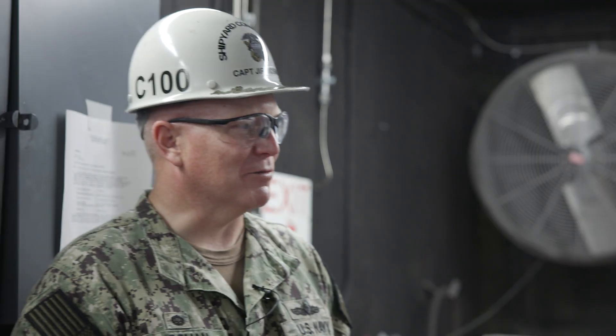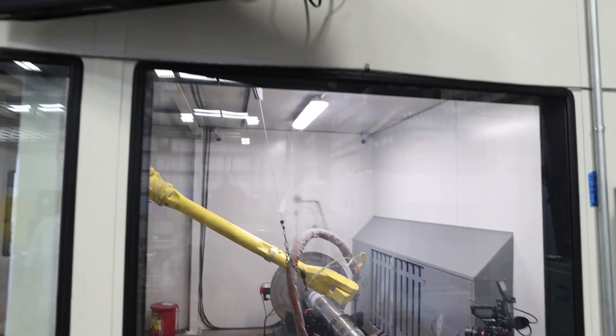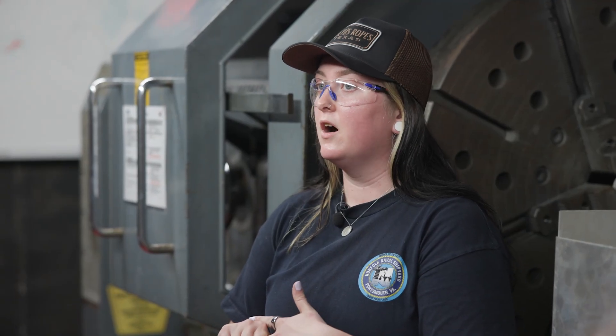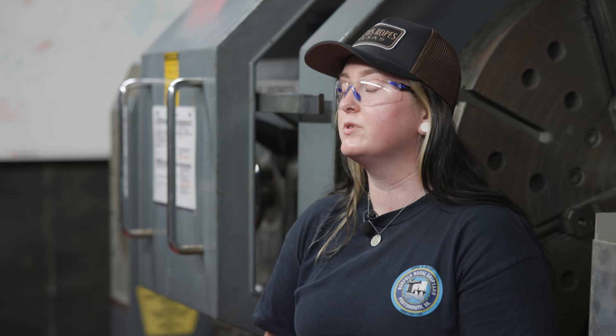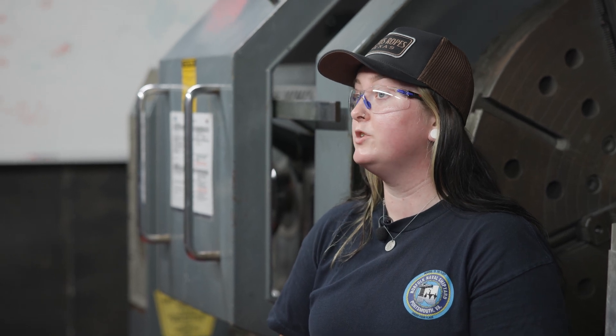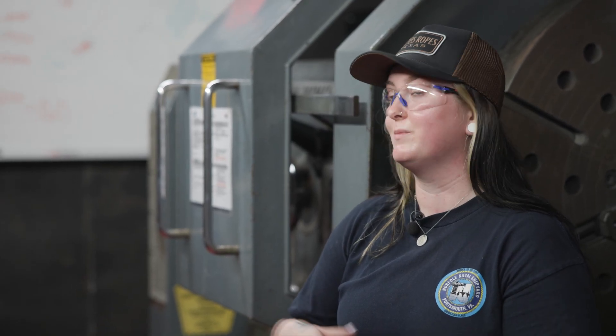What do you see the future of cold spray being? I think cold spray is really useful on shipboard jobs specifically — like the job up in Groton on the Rickover and the one we just did in San Diego on the Boxer. In situations like those, to avoid having to dry dock boats or get boats back on deployment on time as opposed to waiting six months to a year for new parts — cold spray is really useful as an emergency repair. We also do a lot of actuators for sub-safe valves where the prints are obsolete, companies no longer exist, and we don't have a replacement component. So we can fix parts that we no longer have access to — literally taking something very old and making it like new.